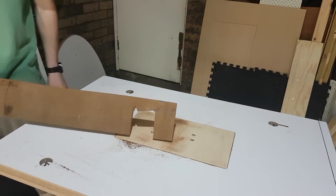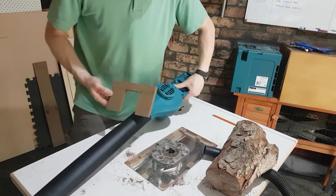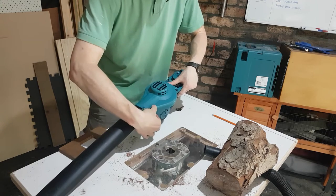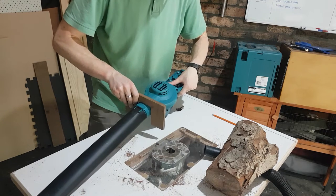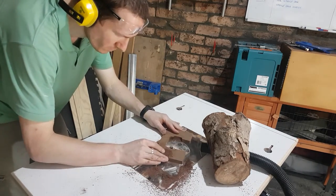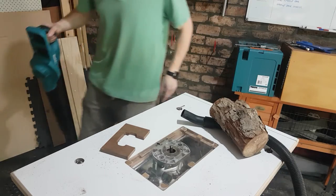I am just the master of excellent cutting. I quickly cleaned up my dodgy cut with the straight bit on the router table. Now to make it fit better — that's how it's going to slide on, and then it lifts up this way. So I need to mark out this widening section, measure it relatively carefully, and notch that out so I can drop this in and have it sit securely and not fall off the wall.